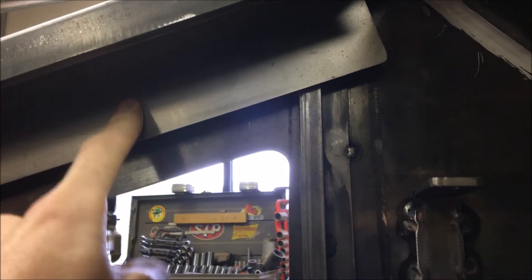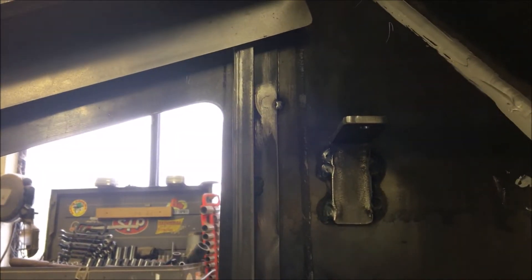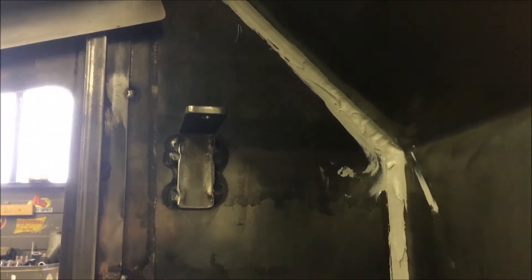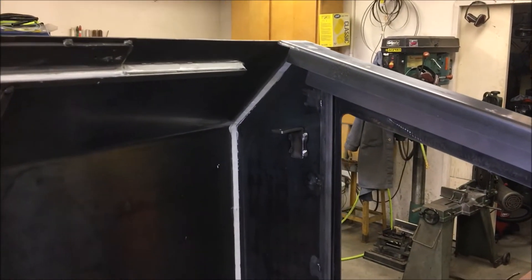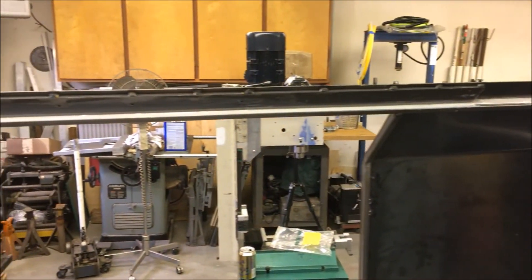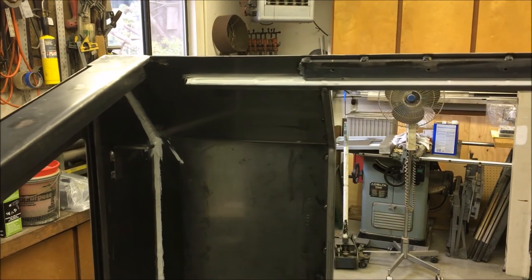This is mechanically flashed for the window, so water can't go down the top. But for things like this — if you're building a car, you would do a seam sealer on the joints — that's what I'll do there. You can see I got a little cocky with it right there — that was the first side. As things went along, my technique improved. The Sikaflex stuff is nice, it's fun to work with, a little messy, but it's supposed to be the shiznit — you can paint over it and it's durable, so I have high hopes.